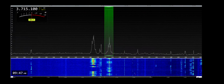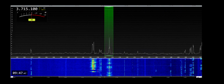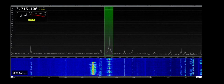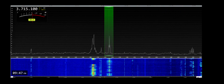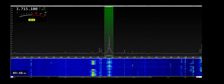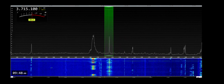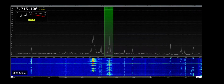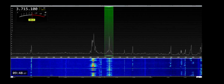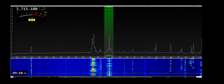George, the answer to your question is the pot I put in where there's just a bolt up in the left-hand top corner of the VFO. There's that little bolt in there. I took that out and put the pot in there. What I had on hand was a 100K 1-watt pot, but it's in series with about a 20K resistor, and the 20K feeds the high end of the pot. The wiper goes into the screen of the driver, pin 6 of the driver tube, and then the pot goes to ground, and that's how I'm regulating the drive level. And it's really holding steady. It's really nice to see and bring it down.